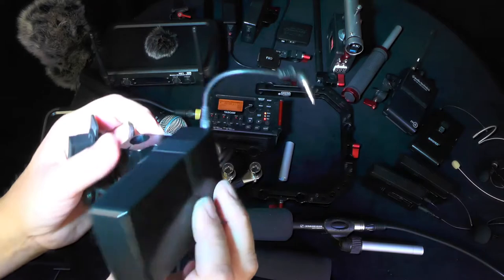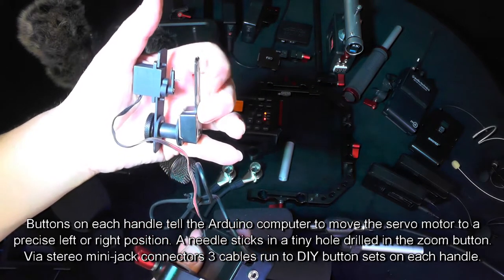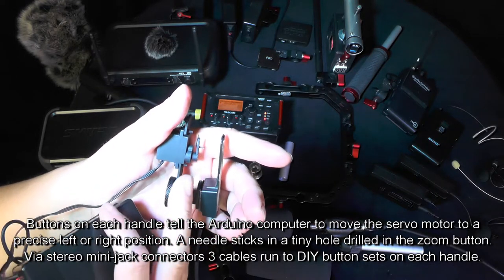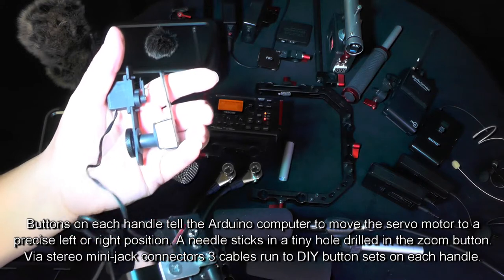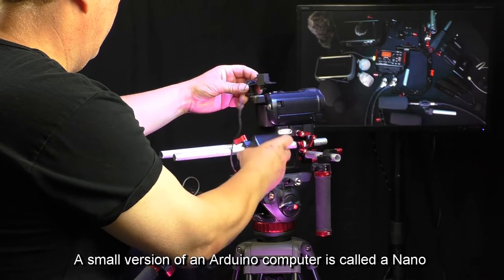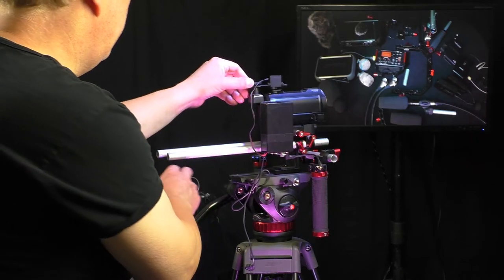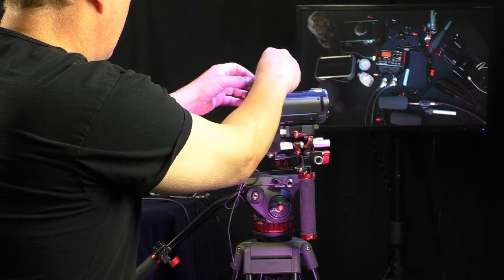But there's my Arduino system. It's made to zoom. I cannot use the zoom button on the camera — first because it's too sensitive, and second it's in a difficult place when the whole rig is ready. So I have a little servo which I put on top, and the big black box holds the Arduino computer. I have the Nano but I haven't had time to make it all in a smaller box. The servo has a little pin I put in a little hole — that's just a mechanical way with the servo to control the zoom button of the Panasonic video camera.